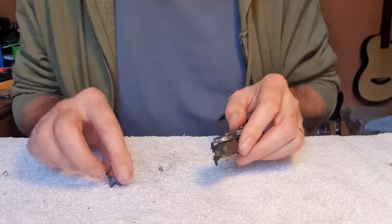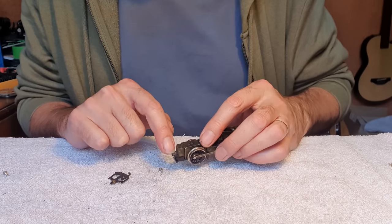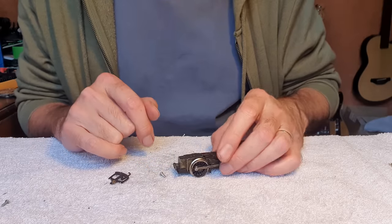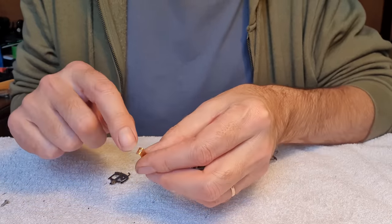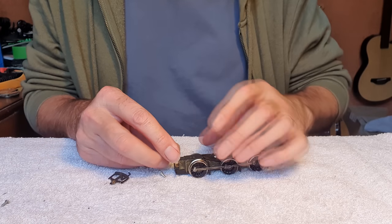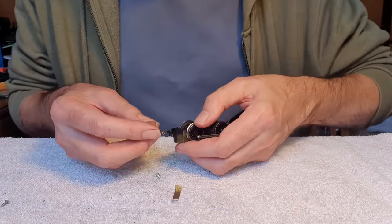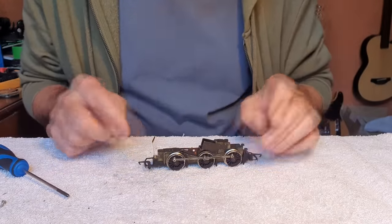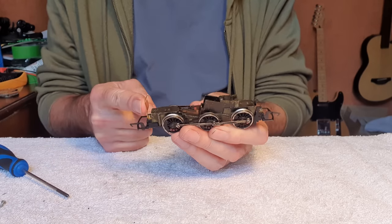So I've taken this coupling off that was held on with this little screw into this hole here. This screw just poked through the top of the hole so I'm going to replace it with this screw which is a bit longer so it'll come up a bit further. And then off camera I have made a little brass clip — drilled the little hole, bent it into shape — and the idea is that it'll be held in there with the coupling screw and act as a little clip on the end. Let's see if this will actually work. Screw it on really tight and there we go. You can see I've bent that so it's coming out a bit and then coming in, so hopefully that will just hold the body on.